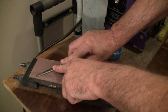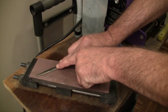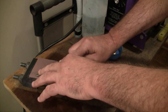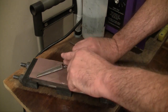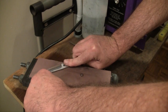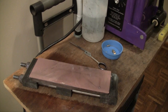I'm going to go on to the stone and do the ramping process now. What I need to do is actually lift the spine up just a little bit — nothing huge, just enough to get the actual ramp on the edge of the tips of the teeth. I'm going to lift and draw back, lifting just a little bit as I draw back, because there's an edge radius there and actual curvature to the blade. I want to make sure I get a ramp at the early entry of the cut and then a ramp all the way down to the tips of the teeth. To do that, I need to roll up that edge radius as well.